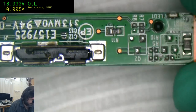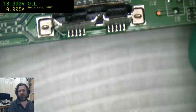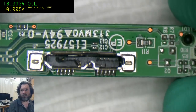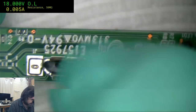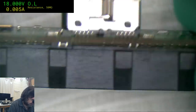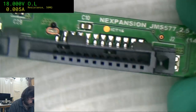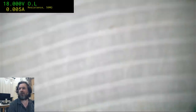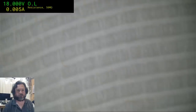But in this particular one, it probably wouldn't have worked because this was a 5 terabyte drive, so it had a fairly high power consumption requirement, which would not have been met by what this could deliver, so I did need the full width. Anyway, it's fixed now, as in I'm just recovering it on my recovery server and got all the data off. So that's all good. Just throw that in the bin, really. There you go. I was wondering what was causing that to fail.